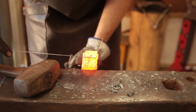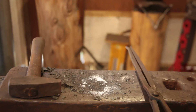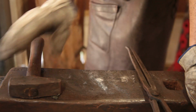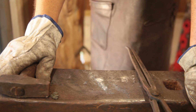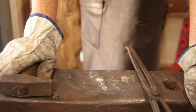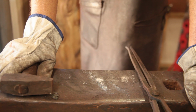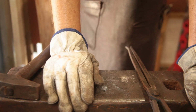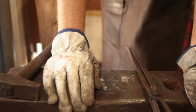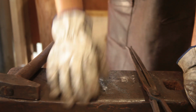Peen is starting to come together. 10 mils to go. Alright, so we're struggling to get that weld to take and to stay. So we're trying a trick where we've domed both surfaces slightly so when they come together they squeeze out the flux and the goo and all the slag and crap, and hopefully we get a cleaner surface to surface mating. We're coming up on welding heat now, but this is a very unstable setup, so it may fall apart.